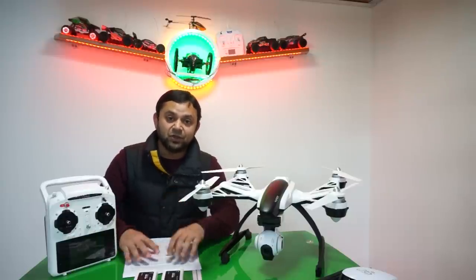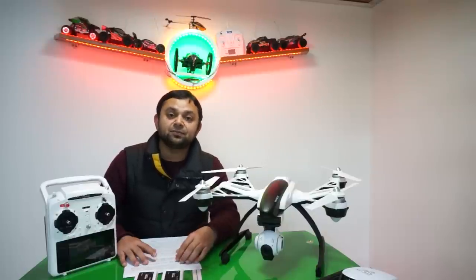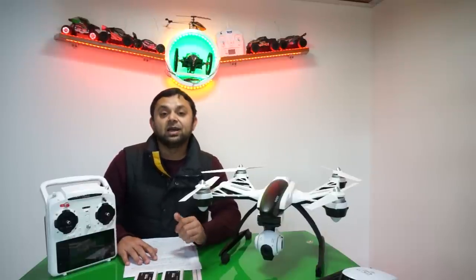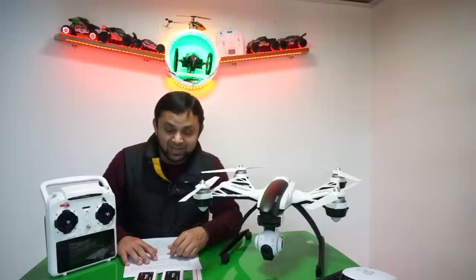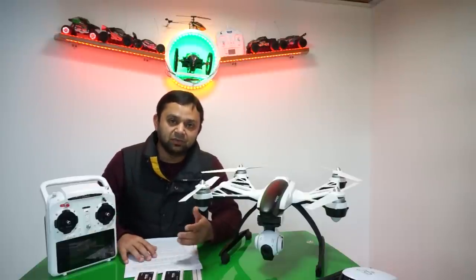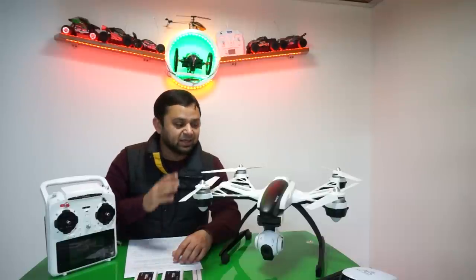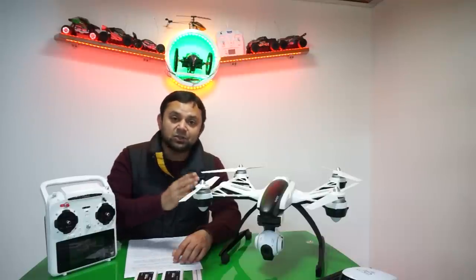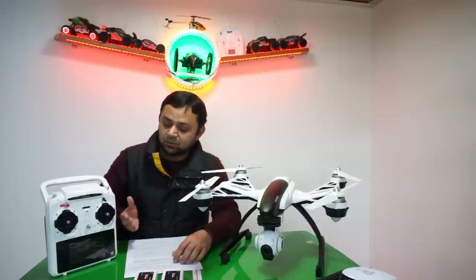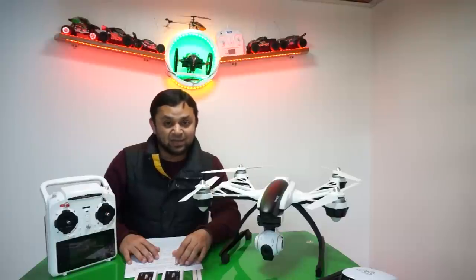So yes, the live video feed has not only a serious delay, but it freezes from time to time, sometimes up to 10 seconds. That is why, once again, I would say plan your aerial filming routes and shots ahead, and take good shots by switching your eyesight from the quadcopter to your live video feed, and you will end up with a good video. So remember that there is this video freezing issue on this one.